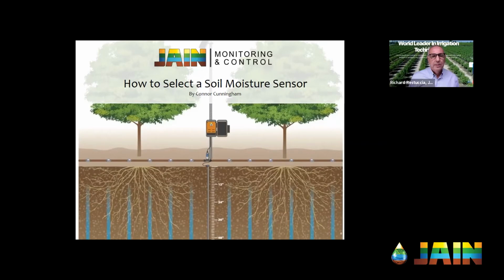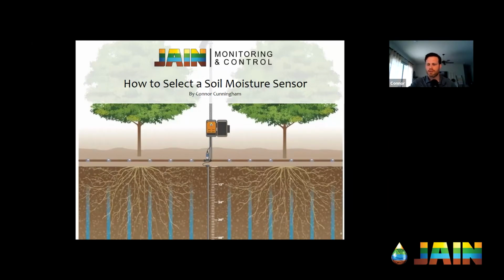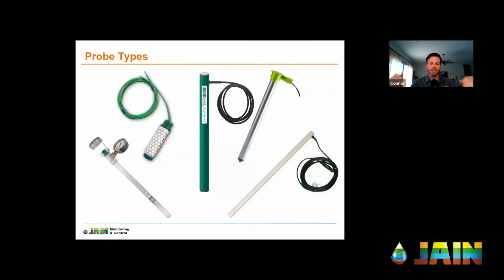Yeah. So, do you have any photos or anything of these? Yeah, so I actually created a visual deck of a lot of the probes that I commonly see here in the field. The tensiometer is on the very left-hand side of the screen here. You can see the little pressure gauge sticking off the side of it. We need that pressure gauge to know that we've refilled it and that we've maintained it properly. And then the gypsum block, what we've just been talking about, is the one directly next to that. You can see it's got its little mesh, and it's filled with the white calcium compound there, and then it's got the little green cable coming off of the top.